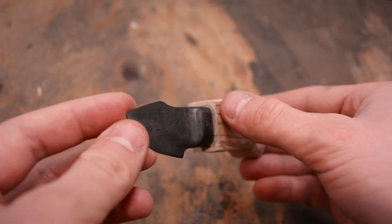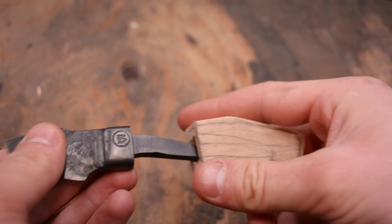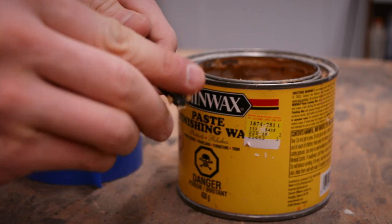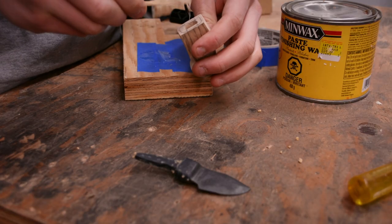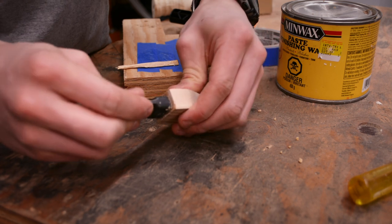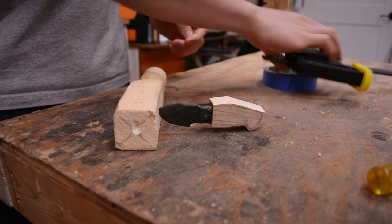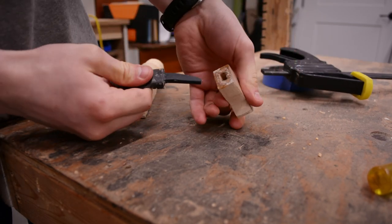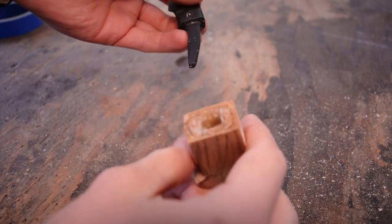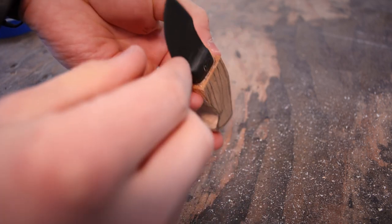Before I get it shaped down to the final dimensions, what I'm going to do is fill the handle with epoxy and have paste wax on the tang of the knife so that when I'm fitting it up it doesn't have any wiggle. The paste wax on the tang won't stick to the epoxy so I can easily remove it later. The epoxy will then leave a hole that is the exact same shape as the knife's tang. I filled up the handle one more time with epoxy off camera because the first time it didn't get fully filled, and now it has a really good fit with no wiggle.